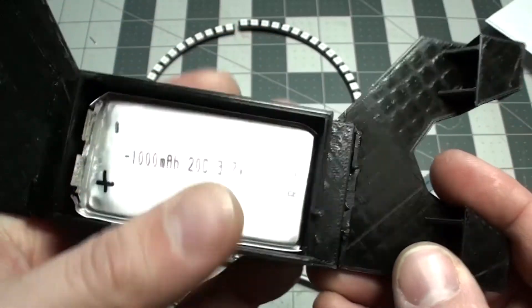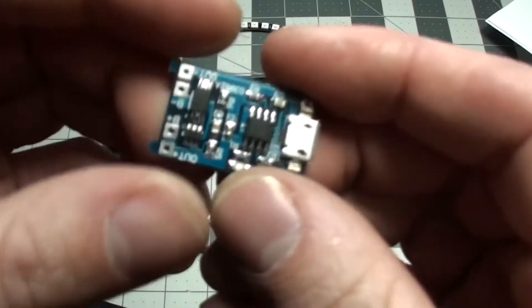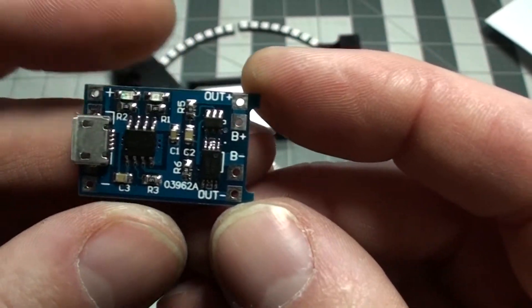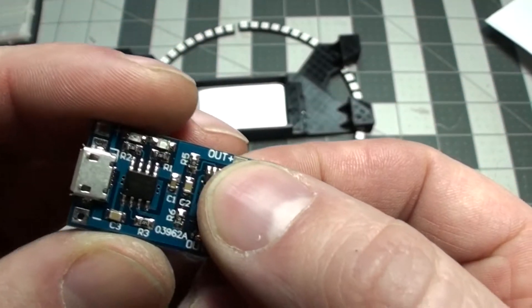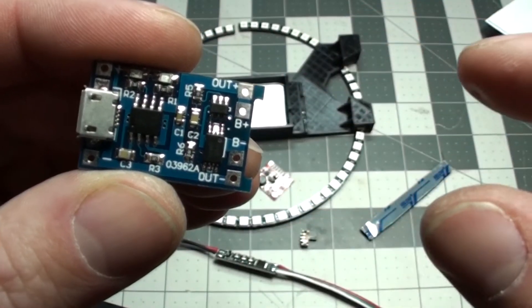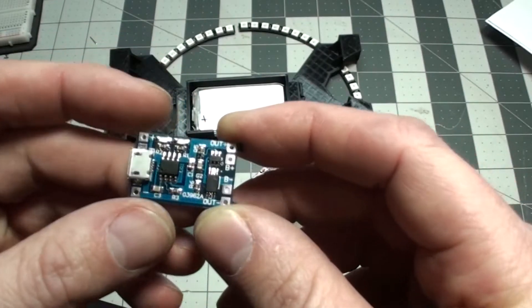So let's go over these components. First of all, we have a 1000mAh lithium polymer battery. Got this off of Hobby King — it is only a couple bucks. I will try to find a link to this exact battery; I think it is still available. Next we have this lithium ion single cell charger. It is what a lot of people call an 18650 charger or single cell 1S LiPo charger. Basically this thing has some over current protection and voltage drop protection. So you hook the battery to the middle two spots out to your device, so the battery is running through the circuitry out to the device. You can put 5 volts here or 5 volts from the micro USB, which is how I plan on charging this thing.